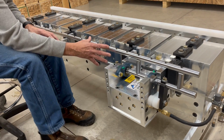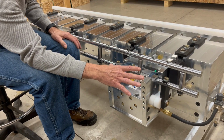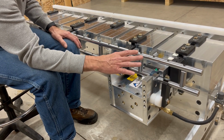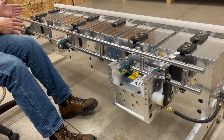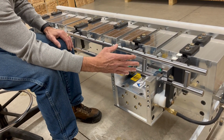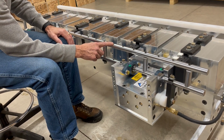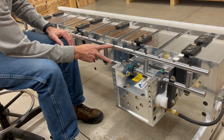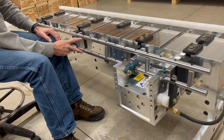So the elimination of the off-center loading also allows you to move this shaker drive anywhere you want, from, say, the far right-hand side of your press bed to the far left-hand side of your press bed, on 3-inch increments. Why 3-inch increments? Because we have corresponding holes in both the tray shaft and the pivot shaft that are on 3-inch centers all the way down the pivot rack assembly.